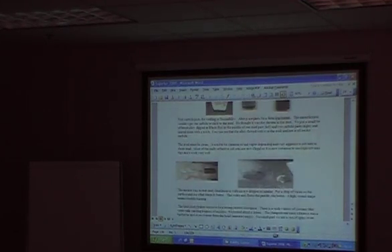When we get down here, this is testing the steel for cleanliness. This is our high-tech eye dropper. This is a piece of steel saw plate. What we did is we cleaned this area with oven cleaner — we recommend Easy Off Oven Cleaner to clean the plate because it cleans oil and grease well, it's cheap, it's easy to find, and everybody thinks it's dangerous. This is the unclean plate. You can see here where you have a high bubble.